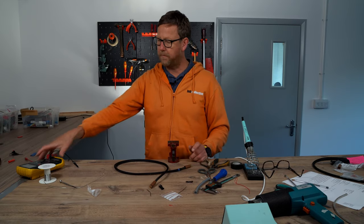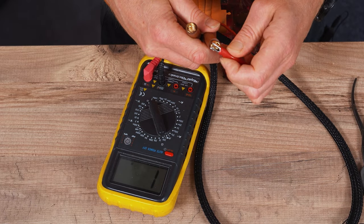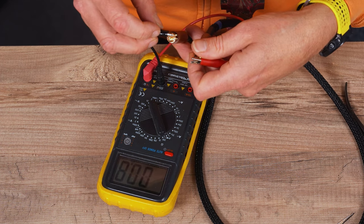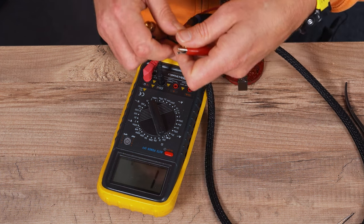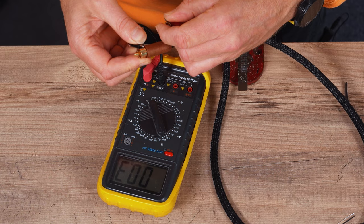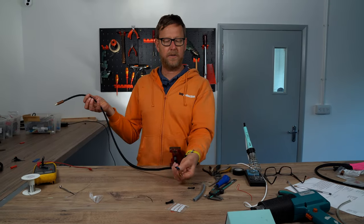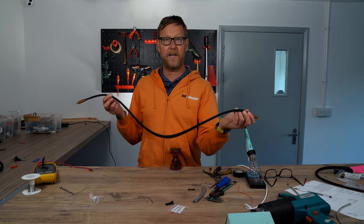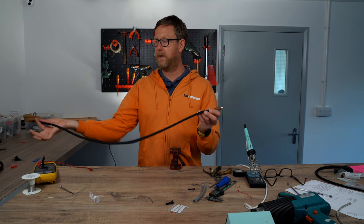Once you've done your cable, best to just do a continuity check — signal end to spigot. Make sure it's not connected to the earth accidentally. And then your earth — that's working fine. Blues signifies the source end, so that could be a CD player, and then this end is the preamp. So the signal's running through the wire that way.